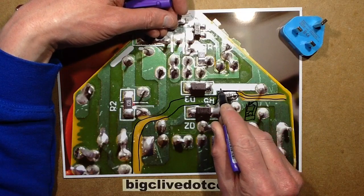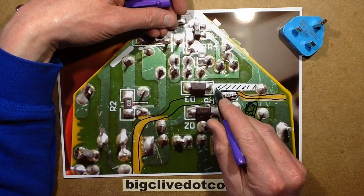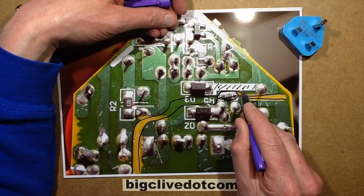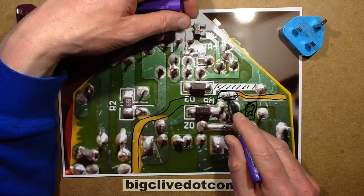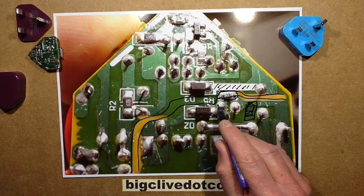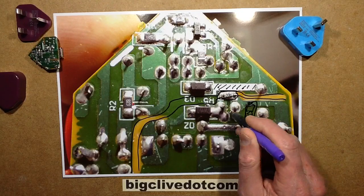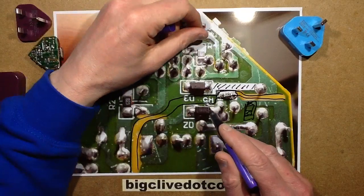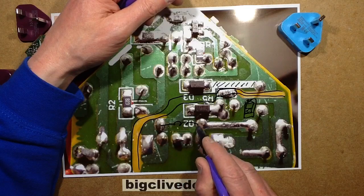The clearance zone that's supposed to run along here — that resistor is right in the middle of it. That means the gap there, if the intended clearance is 1.5 millimetres, is now in the region of 0.2 to 0.3 millimetres. It's so close it might as well just be touching — virtually zero isolation. That's possibly why they printed a little bit of extra silkscreen on the surface, just to try and add a wee bit of extra insulation.